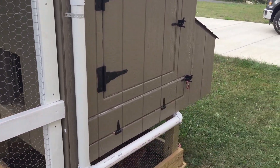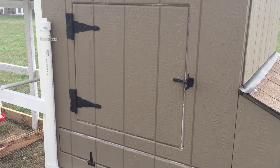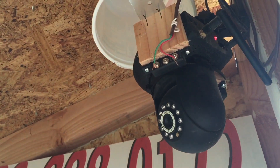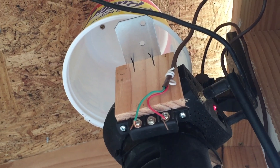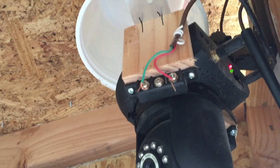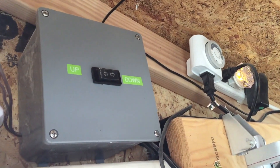In my house we've got a couple of Foscam cameras, which you can use to look around the house while you're not there. So I decided to hook one of those up inside the coop. On the other side of the coop right up here, I've got a camera, and I made a little bracket on top which has an alarm system switch. On the other side there's another one with an alarm system switch. So if I rotate the camera, there's a magnet on the back of the camera that connects either the switch on one side or the switch on the other side, which runs a wire into the control panel. So instead of me physically switching the switch back and forth, it does that with the micro switches.